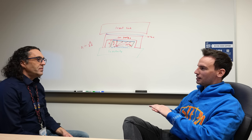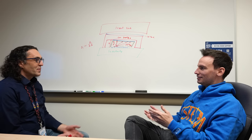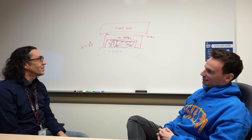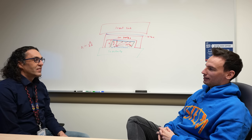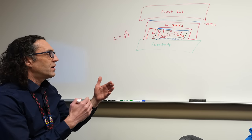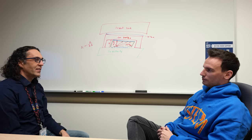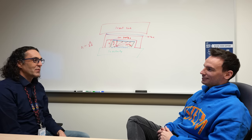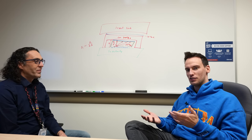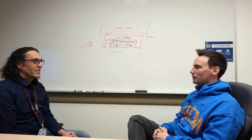The thinning happens after everything is already done — the entire wafer is pretty much ready to go. It's one of the last steps. So if you mess it up, you've just scrapped a lot of work that was done before the die is ready to ship. And if we think about how many chips you make per day — it's also adding to the manufacturing duration of the entire part. Not only do you want to make sure that you can do this well, but you need to do this well many, many times a day — several hundred thousand pieces a day. We did a rough estimation of Intel's entire revenue divided by the average CPU price, and the number of CPUs per day is completely mind blowing.